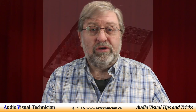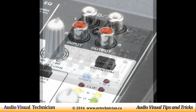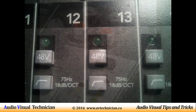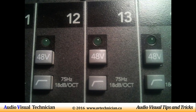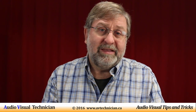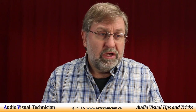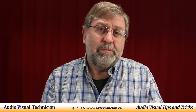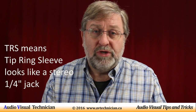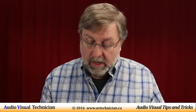If you look at your mixer, you'll notice there's quite often a button to turn the phantom power on or off. On some of the larger mixers, you might have a button that is independent for each of the microphone channels. Phantom power is only passed through the XLR channel — the balanced cable of an XLR connection. Generally speaking, you do not get phantom power running through a quarter-inch jack, even if you have a balanced TRS jack.